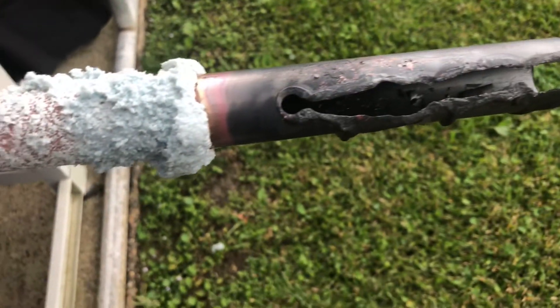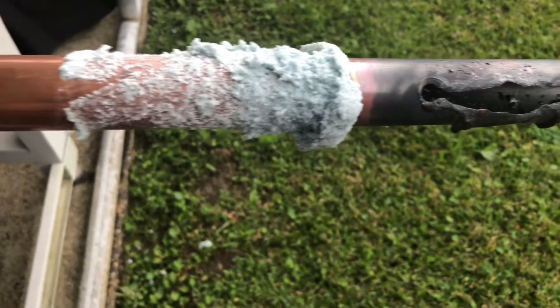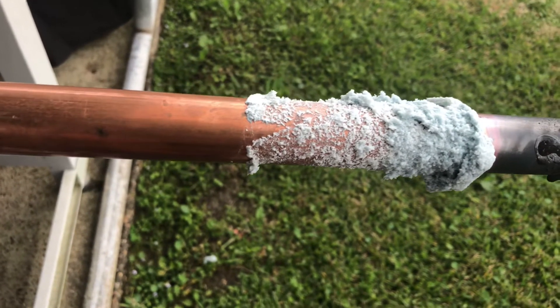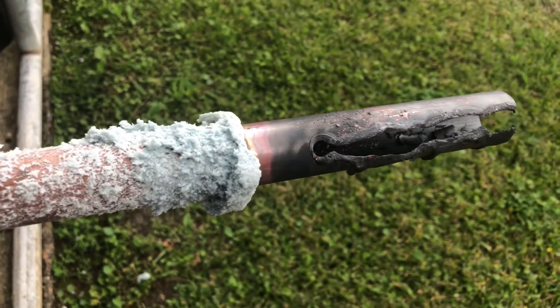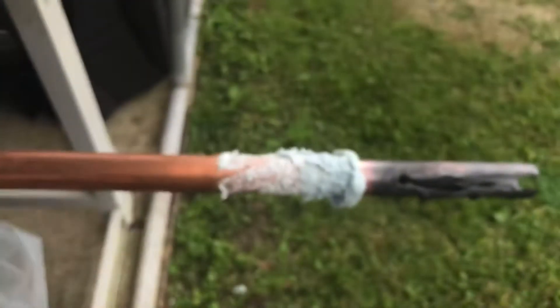So to summarize: the heated side was 650 to 600 degrees, dropped down to 450 after I let the torch off it, and this side was around 200 then came down to 150. So from 150-200 degrees versus 550-600 degrees — that's a significant difference. Like I said, you're going to use this for expansion valves or if you're trying to wrap a dryer, it would prevent it from being burnt.